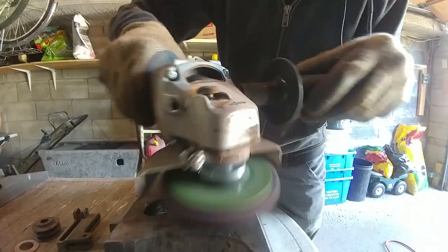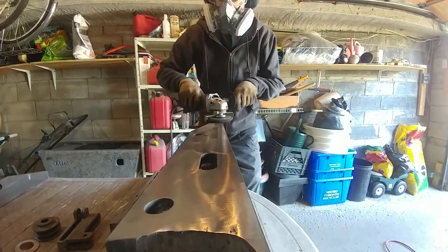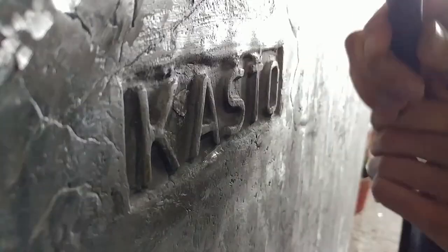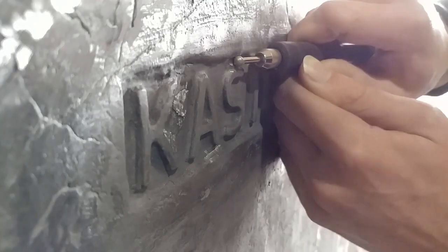The clean-and-strip disc was useful for the paint on smaller parts as well. I also wanted to clean up the nameplate since there were places where the casting process didn't go so well. I used a Dremel with a couple of different sized diamond balls on the end of my little wand thing.